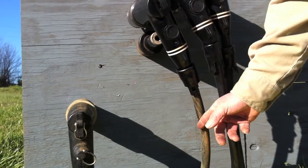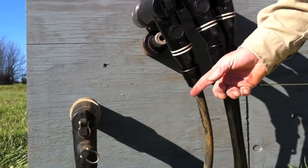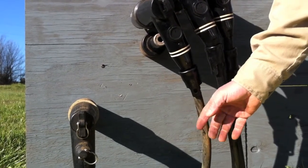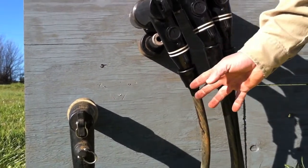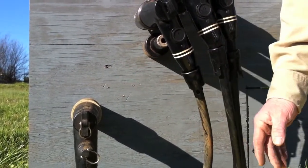One thing we want to talk about is the pigtail that's feeding the transformer from the adjustable bushing. I'm thinking we can use a copper cable, a little bit more flexible, a little more durable, going straight to our transformer. It doesn't have to be that long, but that can give us a good conductor, and we don't have a lot of expense, and that's something easy we can do in the field.